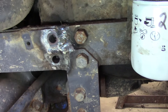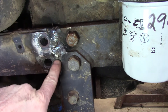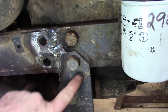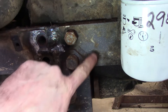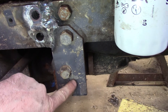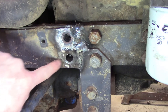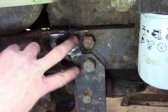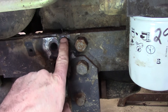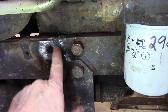I hope you can make this out since it's already been repaired, but the crack went right down through here. This bracket here is welded onto this frame piece — the back of the steering and front drive axle bolts here, and there's a stiffener plate attached here as well. It cracked right down the weld line between these two plates.